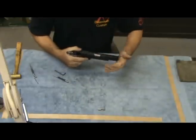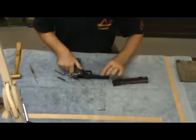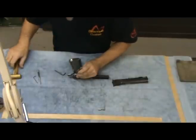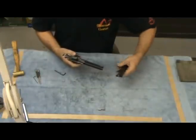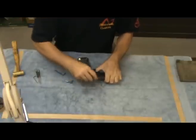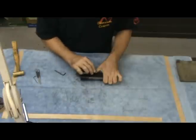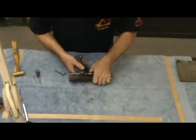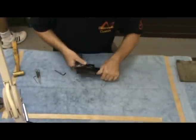As you can see, the ejector pin wasn't pushed evenly with the frame, so we will have to adjust it as the slide would not go all the way through. Line up the link with the slide stop hole and insert the slide stop. Line that up with the middle notch, press down into it, and the complete firearm is assembled at this point.